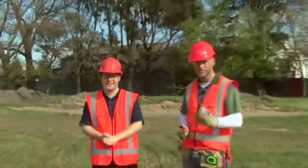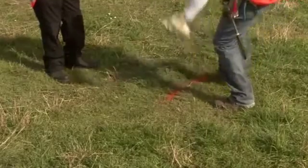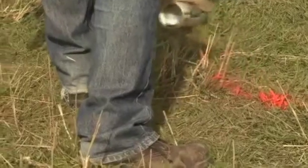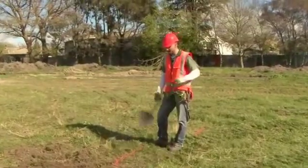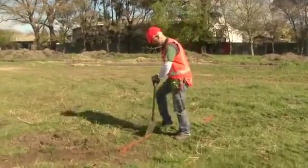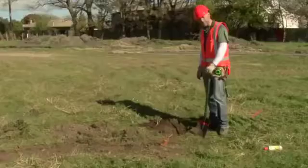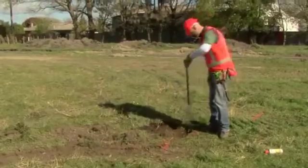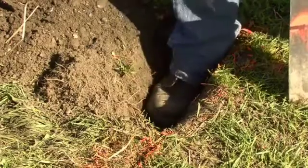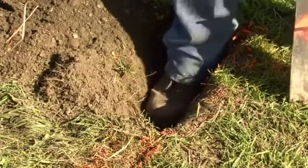We've checked safety, we've got our gear sorted, we've double-checked our erosion and sediment control plan to make sure we're in the right place. Now the first step is to dazzle and dig — Paul's going to show us how. I'm just going to put a return in and then mark your line. There are basically two ways to dig a trench: you can either use a spade or you can use a digger. You need to go down 200mm to your mark on your spade, then just stick your foot in the trench. It needs to be at least the width of your boot so you can get the cloth in the bottom.